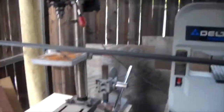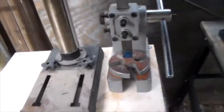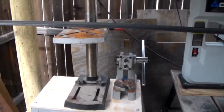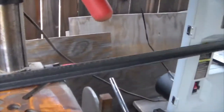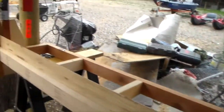Now the angle iron, which is the first time we've used this drill press out here in the metal area. I bolted that top to the stand and then fixed the drill press to the top with some easily removed big thumb screws there, in case we have to move it to drill something tall. So now I gotta go see what I got for screws. I can go through this strong and not go all the way through the 3/4 inch wood here, and put them probably every, I don't know, 6 inches down there.